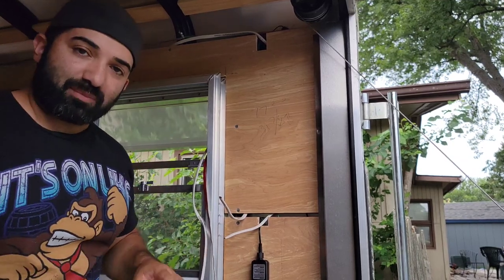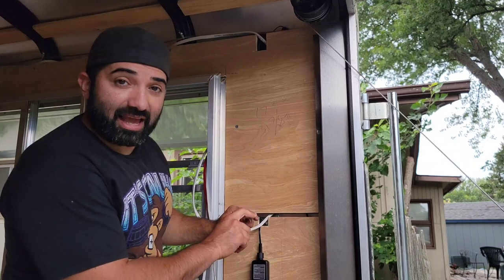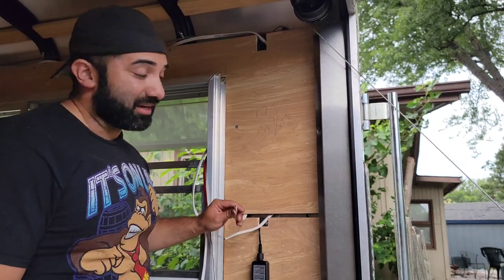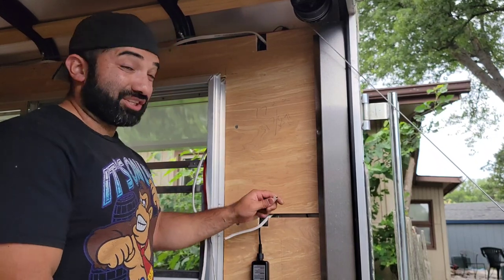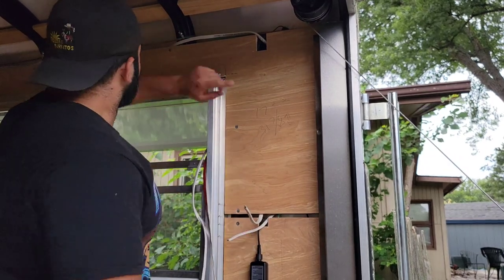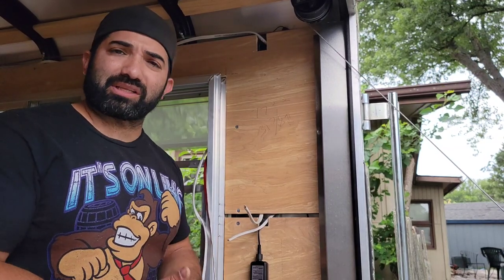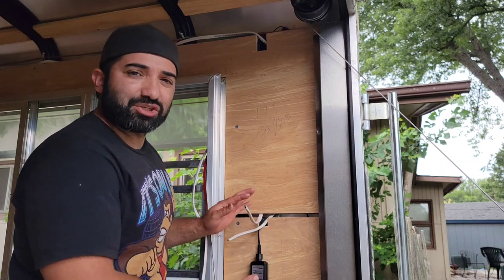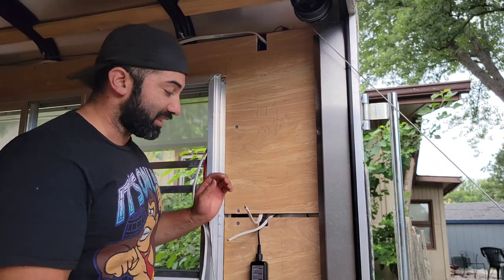And if you guys remember, on the 14-3 wire, we're going to use one of these as a, actually, we might have to run one more wire over there. You know why? Because we need power, because we're going to have outlets here. These are just going to be our switch legs. So unfortunately, we're going to have to run one more wire all the way across right here just for our power to feed our outlets and things like that. Because you want to have an outlet here just in case you need to plug in like your cash register, your phone, or anything like that.